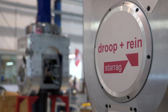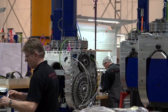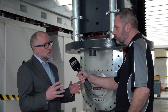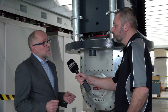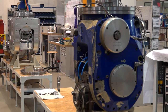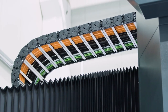Something unique in your business — you've got a spindle production line here and repair service. Does that give you a distinct advantage in the marketplace, Lee? I think it gives us a unique advantage. Across the range of different machines that we build here, we have the capability to look at a component. We've got 300 existing head designs that we can choose from to get to each feature, or we can design new bespoke heads, and we manufacture them here — we design them, manufacture them, and refurbish them here — so customers have got a through-life programme confidence that we can look after them. In this particular case we've got an overhead gantry high-speed machine with a high-speed five-axis simultaneous head with interchangeable spindles.